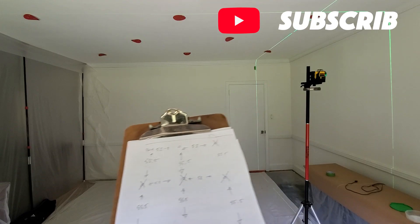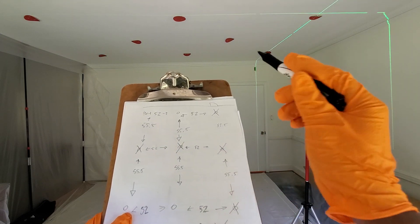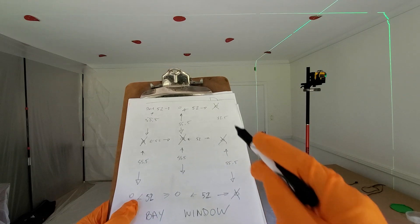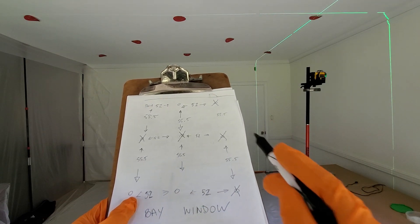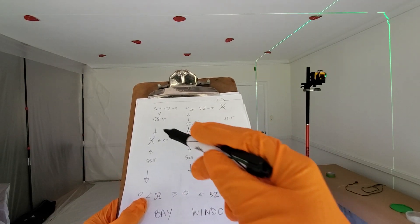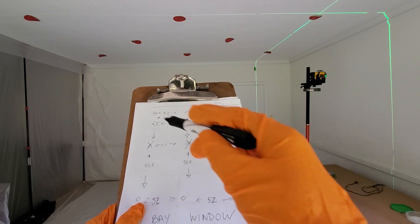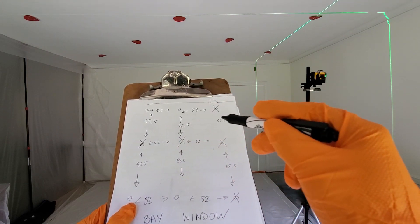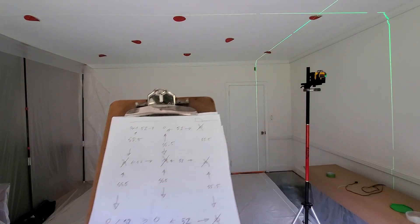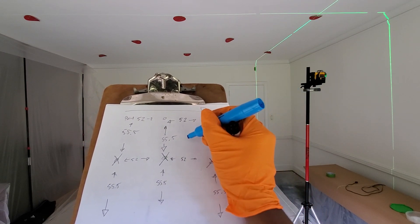If I move the camera around here, you can see we've got our three rows of three on our diagram, and we're going to go back through and add our four additional lights. If you look closely, you can see we've got the same spacing all the way across between our top two rows, and the spacing is also the same between our bottom two rows. In this location we had a chandelier in the center, so all of our spacing is based off of that as our central focal point, since it was so close to the center of the room.